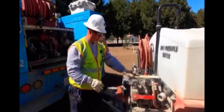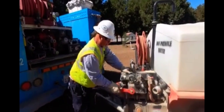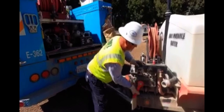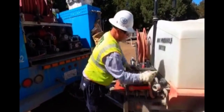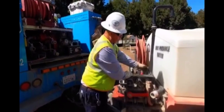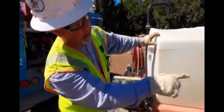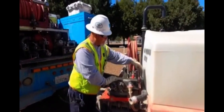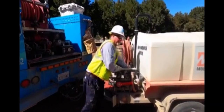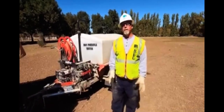Make sure that your levers are in the proper position. Quick review: lever forward is for vacuum or filling the tank; lever pointed back towards the tank gives me pressure and charges all three discharges and the hose reel. There's one more bar right here — this is the rear spray bar. If I open this and turn it up I'll get water out the rear spray bar. To have water going to the manifold, this rear spray bar lever has to be in the down position — that's extremely important.